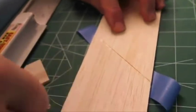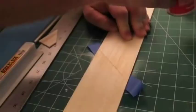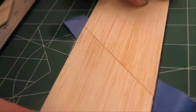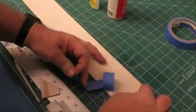Lay the sheets down and use some scrap wood to remove the excess adhesive. Sand the seam lightly with a sanding bar and apply a fine mist of zip kicker glue accelerator. Sanding the splice forces wood dust into the splice and that acts as a filler. Once the glue is set, flip the sheet over, remove the tape, sand the splice, and apply a little more kicker.